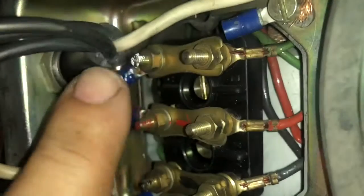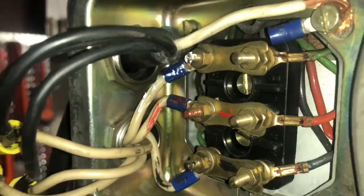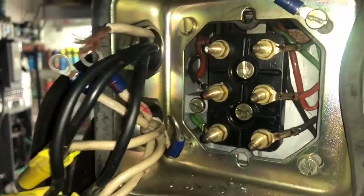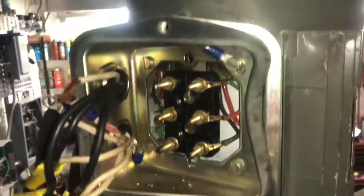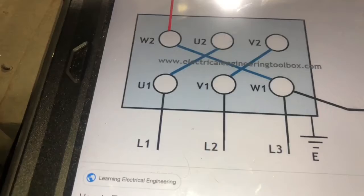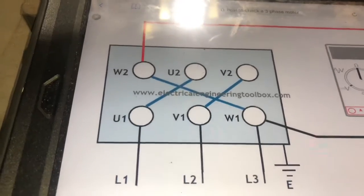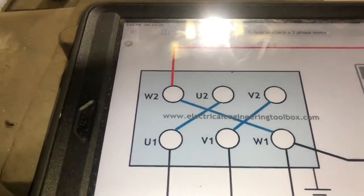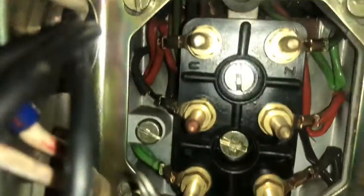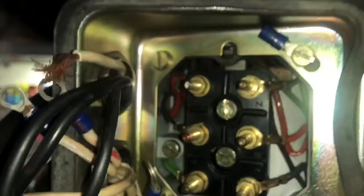What I'm gonna do is pull these off here and then we're gonna test the resistance and the ohms, and make sure nothing's shorted to ground. I got all that pulled off and as you can see I pulled off the little dog bones, because when you check for resistance on these motors you actually have to check it like this. You've got W1, V1, and U1, which correspond to the same on the other side but in kind of an X pattern. This one has labels U, V, and W, but on the other side it's X, Y, and Z — it's the same thing. You always pretty much go by a pattern like that.